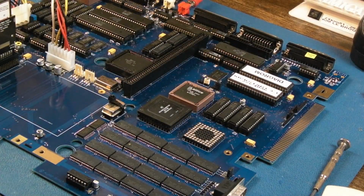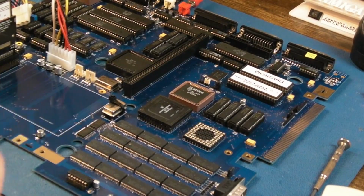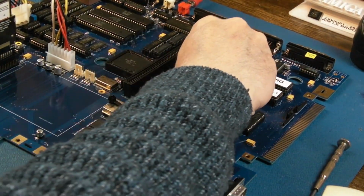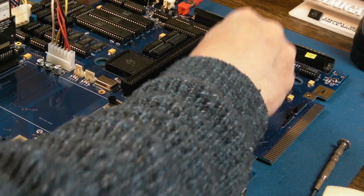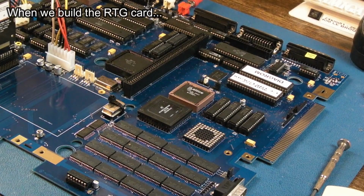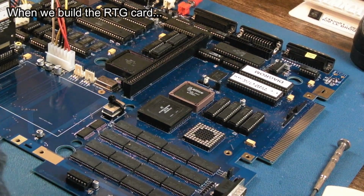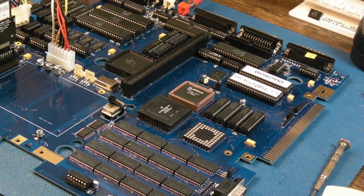Anyway, yeah, I'll just clean up around there. I'm just going to leave it without the flash ROM for the moment. I've still got to jump it up, and we'll just stick with the standard ROMs. We may need to revisit though, because that's going to need 2 meg of Zorro 2. So we could end up only with 4 meg of RAM if we're not careful.